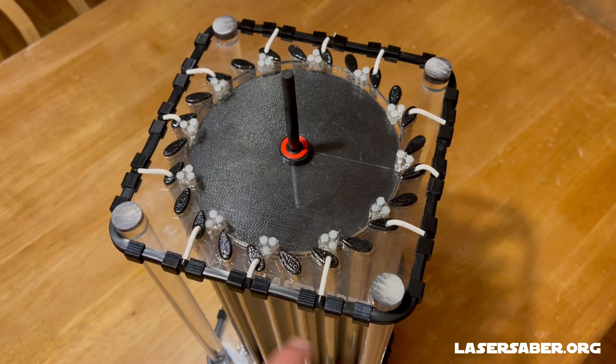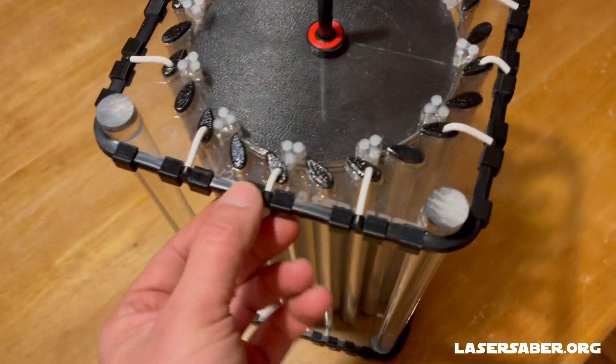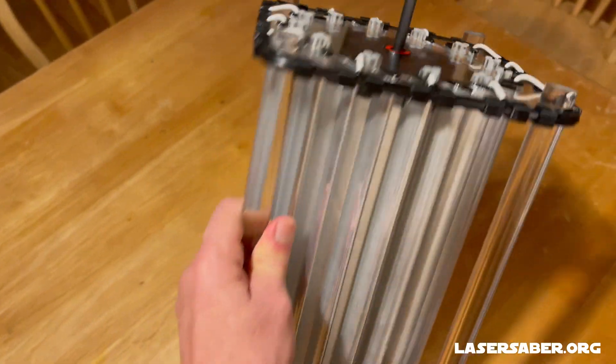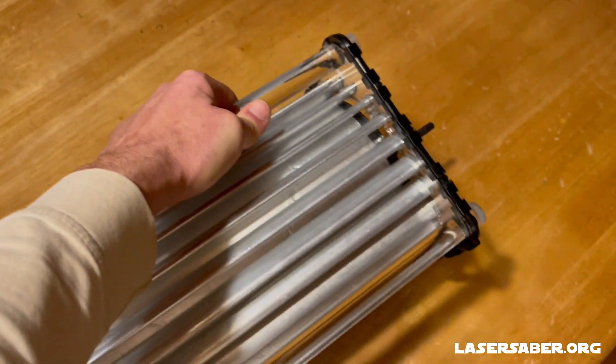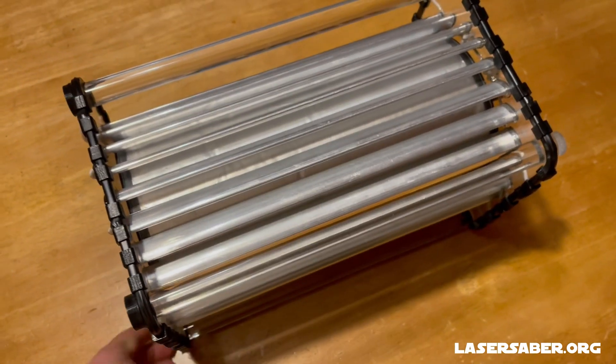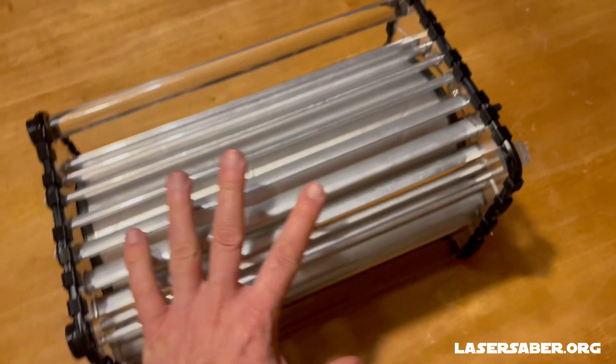The wiring is all around the outer ring here, wrapped with electrical tape and held down with clips. Even with that, because of the high voltage DC, I wouldn't want to run this on a conductive surface — I would put it on glass, a nylon cutting board, or some other non-conductive surface.